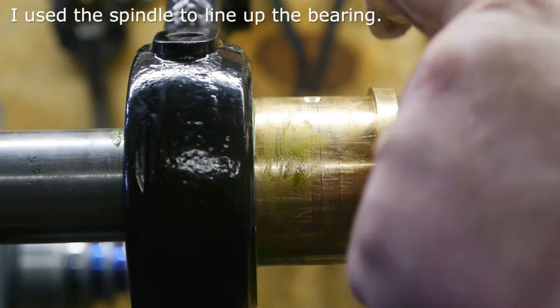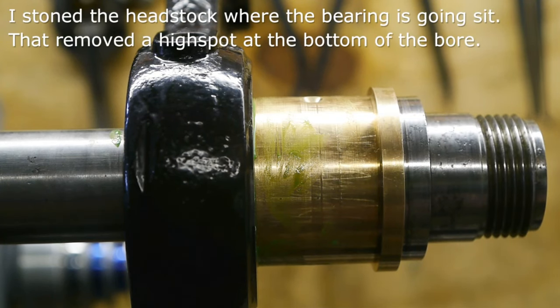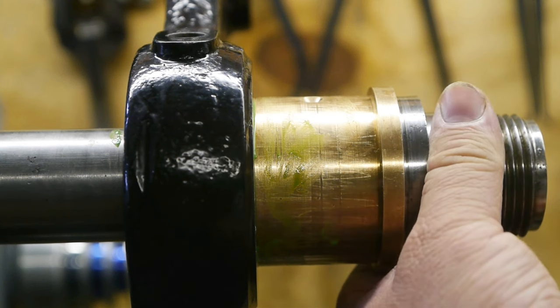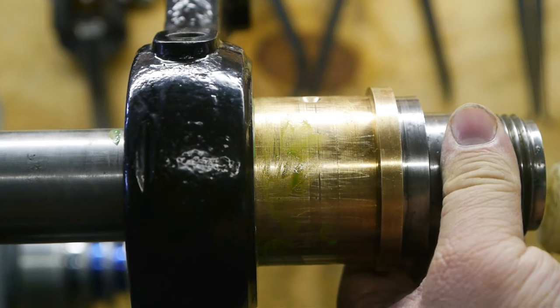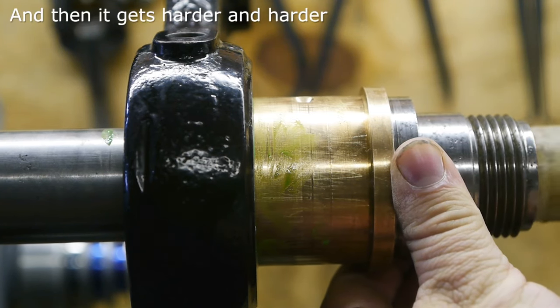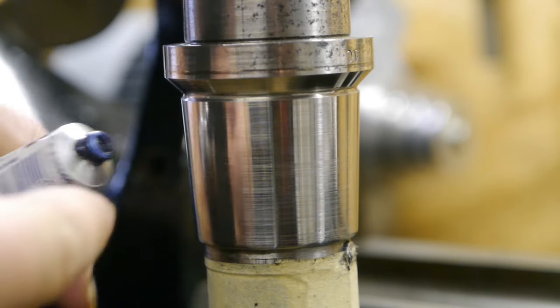Making sure I got the oil hole lined up. This Loctite is anaerobic curing, so that means it hardens in an airless environment, and it takes about 24 hours to cure. I thought about using CA glue, but that isn't really temperature resistant. Yeah. It goes in easy enough. And now I get to do a little finger painting.